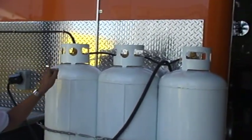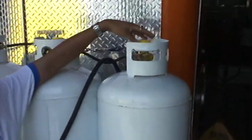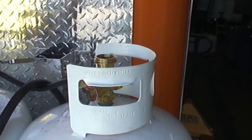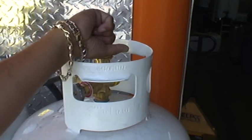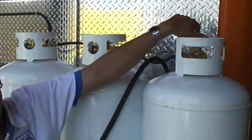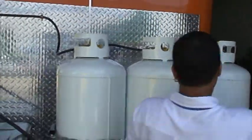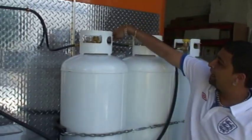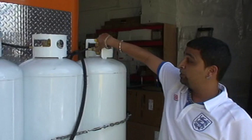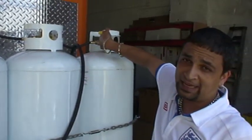25-gallon, 100-pound gas tanks. These are top-filling tanks. This typically means that your gas company will come out, put the hose on the tank, and fill directly from the top without taking these tanks off. Empty tank is 68 pounds. A full tank is 168 pounds — they're heavy. This is a manifold, which means you can turn one tank on. We suggest you turn all three tanks on to maximize the efficiency of the tanks and the equipment.